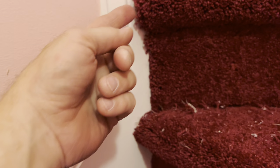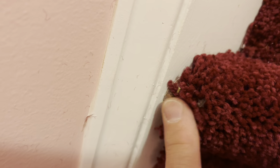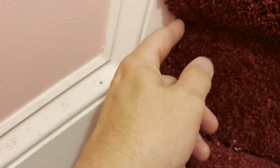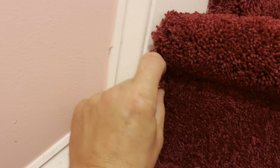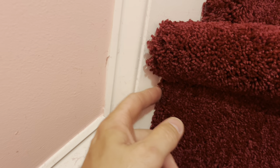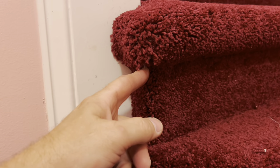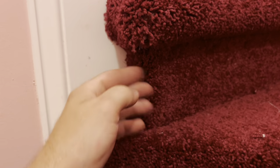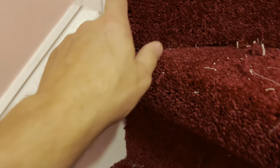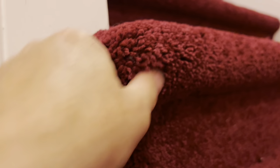There's a whole lot to do with this — it's just short. If you pull back you can actually see the tread. He put a staple in the fiber trying to hold the fiber over there to keep it fluffed. Right here I pulled this, cut a bunch of extra off, and tucked it back around in there so you can staple it there — still got a little dressing up to do in that corner. On this one, because it was sloped down so far, it was stopped way out here, so I actually cut this back probably an inch or so to the actual riser and then it would fold around there flat. I'm going to pretty that just a little bit more and then we're going to be done on these steps.